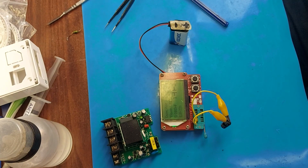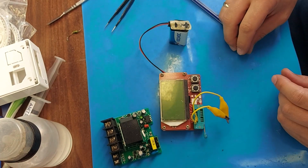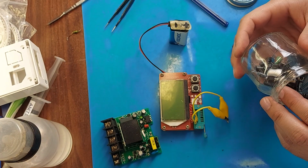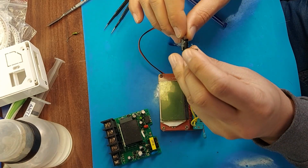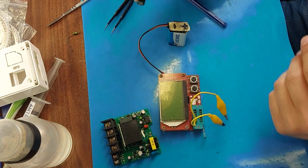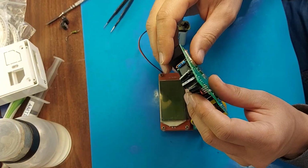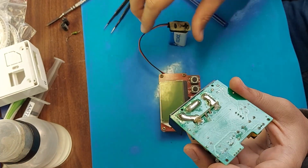As far as I remember, there are 1000 nanofarads in 1 microfarad. It turns out that it is close to the required characteristics, but the ESR is suspiciously high. Let me check my spare capacitors and see what the ESR is. It shows 1.1 ESR. In terms of capacitance, the capacitors are almost normal, but in terms of ESR, the characteristics are too high compared to other capacitors.